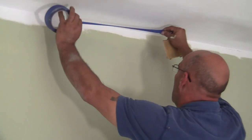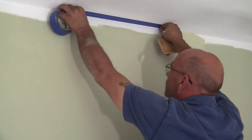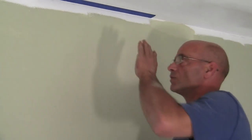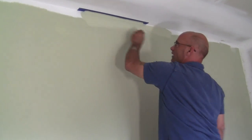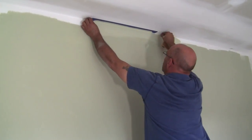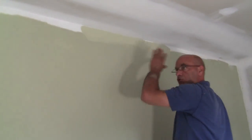The other way is using painter's tape or regular masking tape. You apply it on the edge that you are not painting, pull it tight, make sure it looks good, give a little pressure, and then continue along the whole ceiling like that. Then get the paint brush and just paint up against it. After the paint has dried a little bit — not soaking wet — you just pull the tape back off, and voila, gives you a pretty good straight edge.